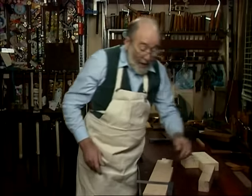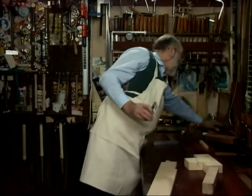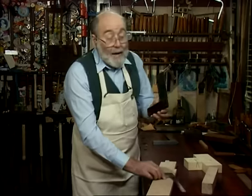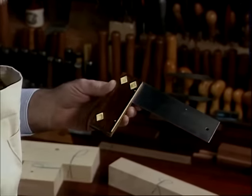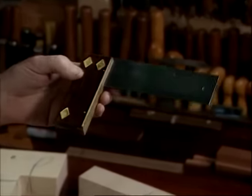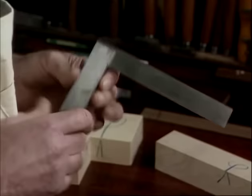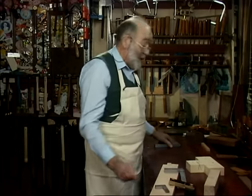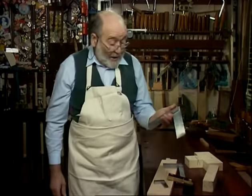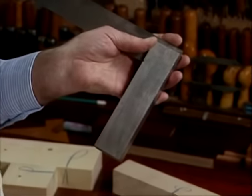Last but not least is the square. You'll notice I'm using an engineer's square. Most woodworkers have a try square, but unfortunately they're reputedly inaccurate — they get dropped on the floor and go out of accuracy very quickly. An engineer's square is a little more robust, and what's more, it doesn't cost much more. They come from little tiddly things to great big ones, and they're made to a British standard. Now we come to setting out.